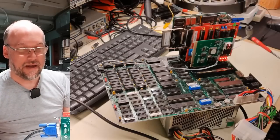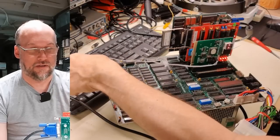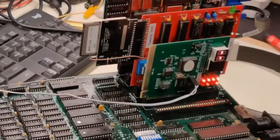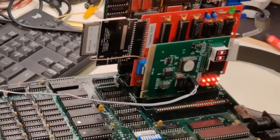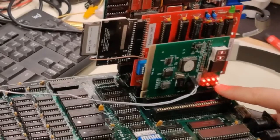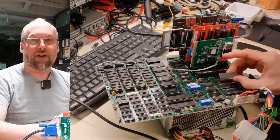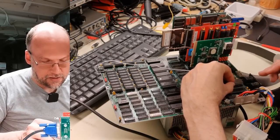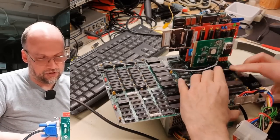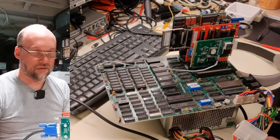Okay, it's on. Is it working or posting? I haven't heard any beeps. That's not a good sign. I don't think this thing is even trying to POST. There's a missing ready light on the motherboard that should come on if the system were working properly. It goes in and out of reset normally, but that light is not coming on, so I don't think this thing is actually doing anything. I'm going to pop the CPU out and install the one off this clone motherboard. It's not out of the realm of possibility that this motherboard was retired because of some kind of fault, so that might require a more in-depth troubleshooting video.